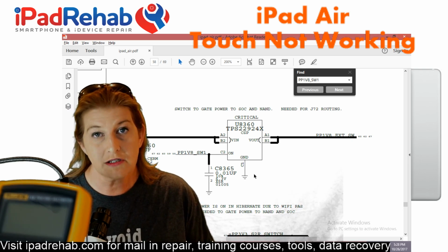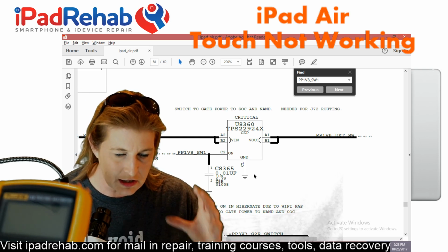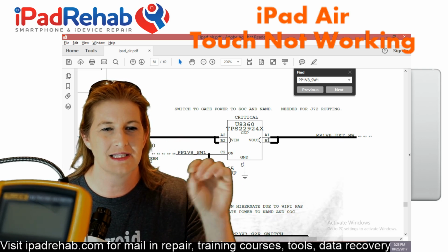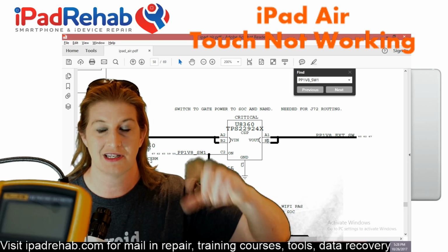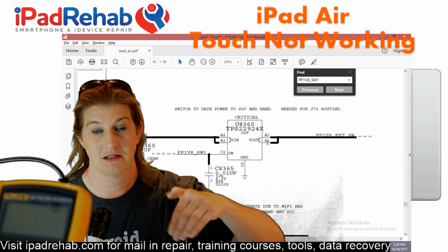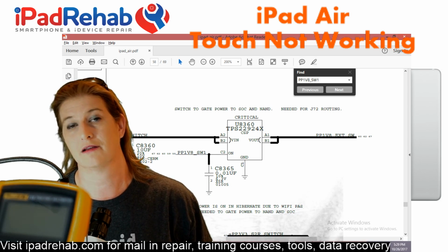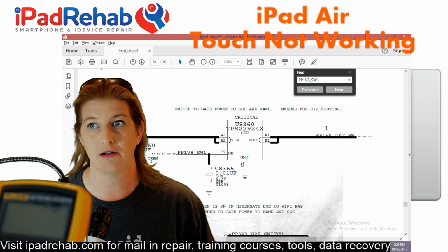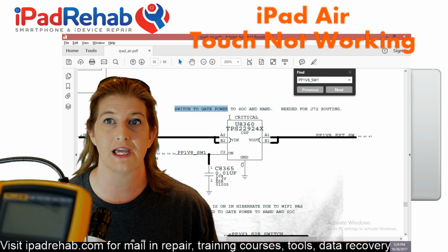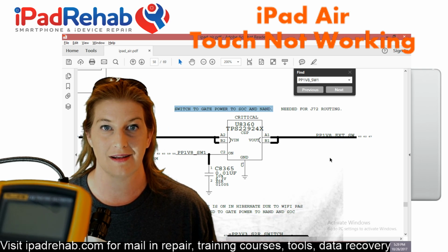And then when we looked at the board at the course, guess what we found? Under the microscope with that really crisp visual diagnosis, this chip here, U8360, had been slightly tweezer damaged, and it's right next to the NAND. So in his NAND removal, he had kind of nicked it. So we asked the question, what does this chip do? This is the PP1V8S2R extension switch, in and out, it creates this PP1V8 extension switch. Where does that go? It's a switch to gate power to the system on a chip, CPU, and NAND. So this is NAND power, and he nicked the chip.